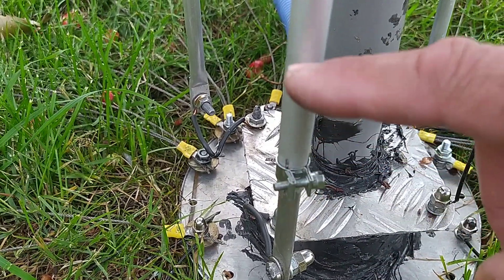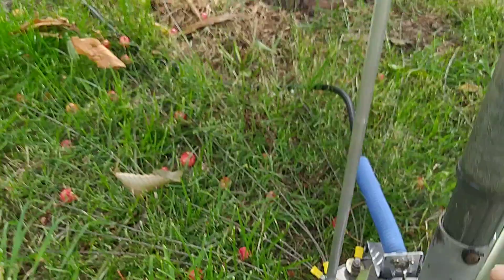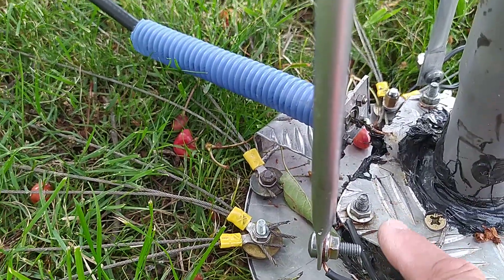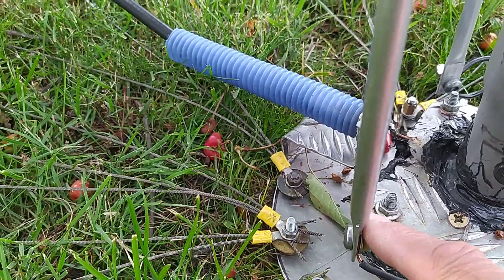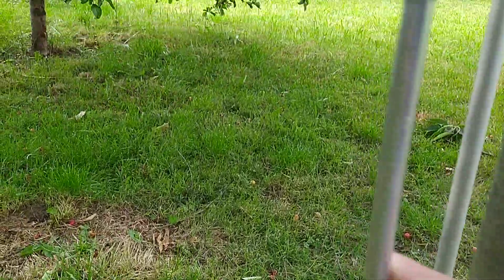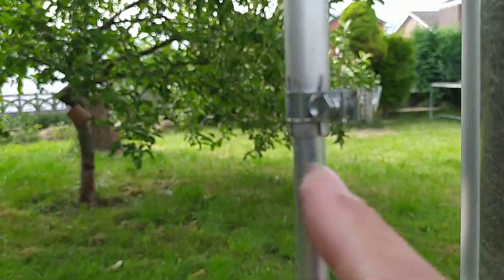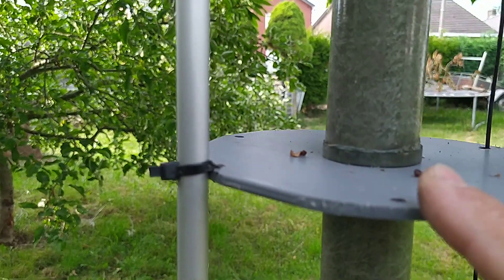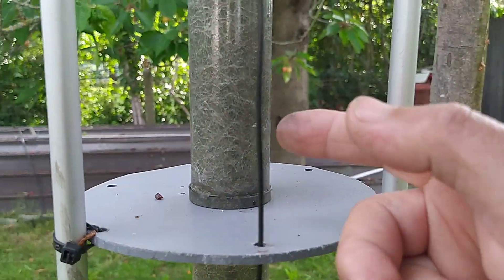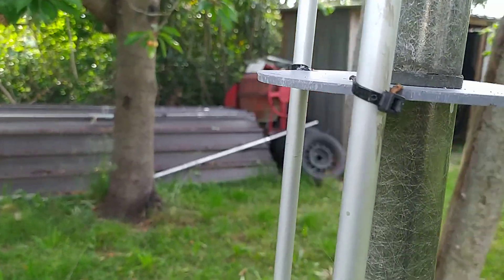The 10 meter element is connected to the upper plate, and this one is also connected to this plate. This element is the 15 meter element — I can adjust it here for the SWR. The SWR is perfect; I fine-tuned it. And this is my 40 meter wire.